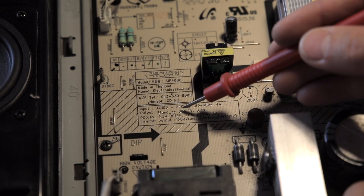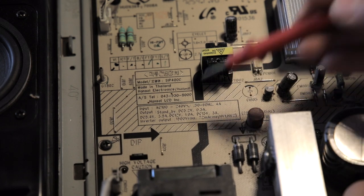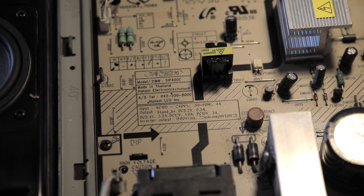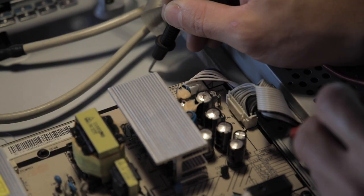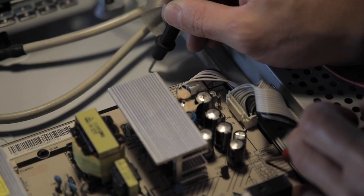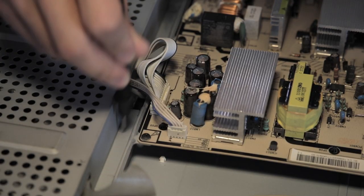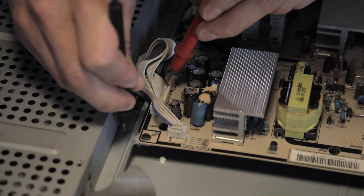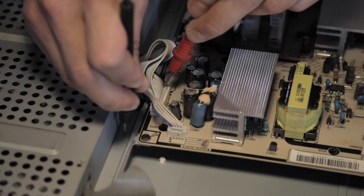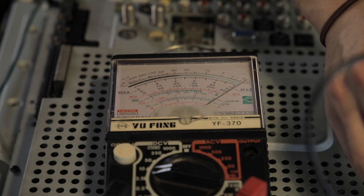What's awesome about this is it shows the voltage should be 5.2 volts on this pin. So we're gonna measure that and find out if it still sustains 5.2. You can see at pin 3, standby STB 5.2. Put this in ground — stick it somewhere where there's ground — and see what the voltmeter says. All right, so at 5.2 DCV.